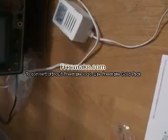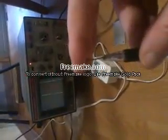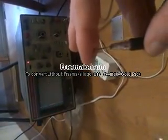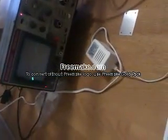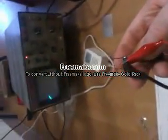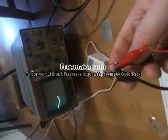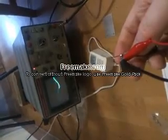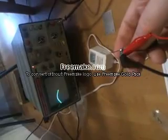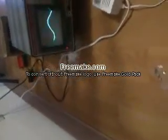So if I touch this, another thing is you want to make sure, when you do it with the oscilloscope, which is going to be hard for me to do, that you do not touch the tip of it. Watch, you want to touch the tip here. You see, it's starting to do something funny, and it's picking up a signal. It's probably picking up a sine wave, I believe. So I touch the tip right here. As you can see, the tip is touching the left channel, and we're getting a signal on it. I have it shrunk down to a perfect sine wave, but the thing with this type of circuit is you're going to have to mess with it to get the voltages correct. That's because if it's too high, it'll have a minimum of whatever those diodes have before the voltage drop.